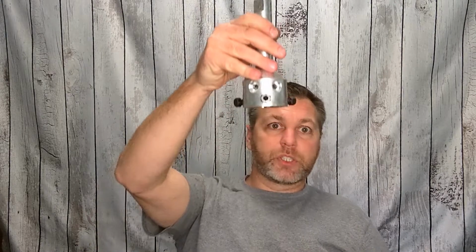So at that point, if the motor's sitting still on the ground or on a bench, you keep doing that, this thing will push itself up off of it, and the fan blade will come off. Or you can have it where it's braced up a little bit. You have to be very careful with fan blades, because especially modern ones are extremely flimsy. And you don't want to let the weight of the motor hang on them, because you can bend them, and then you're out of balance, then you're SOL anyway. So either way, be careful with what you're doing.